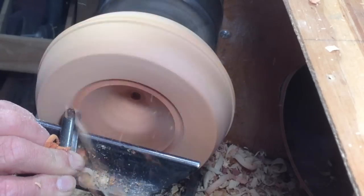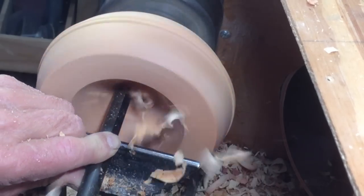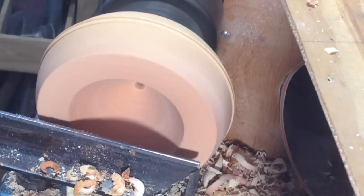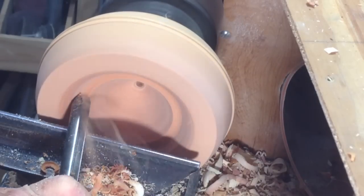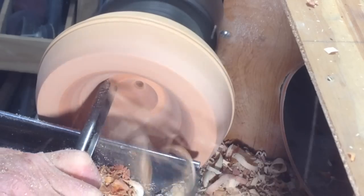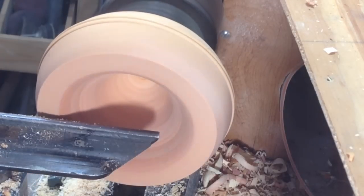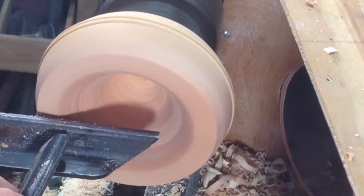In on its side, rotate very slightly, pick up a bit of cut. Remove the light so you can all see what we're doing. I like to get to the bottom of the hole — at least I can see the bottom of the depth hole, so I know where all the other cuts are going to end up. Now I can transfer to the bigger gouge — a half inch deep fluted bowl gouge, half inch flute.